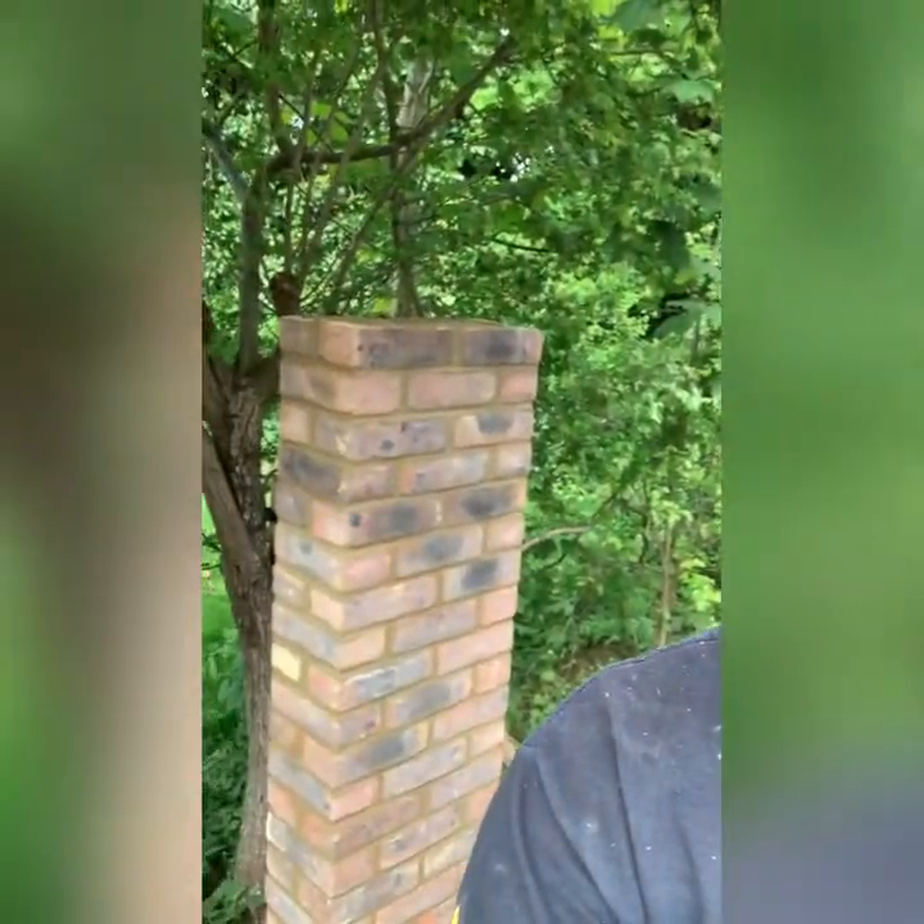Head over to bontool.uk and get yourself one. This is the 13-inch or 11-and-a-half-inch horse hair brush — best thing for brushing off brickwork. It leaves no brush marks. If you want to start making your jointing look a lot better — if you're already good at jointing but use a normal soft hand brush, you get the odd lines here and there — if you use the horse hair brush and brush off straight away, no lines in your mortar. It leaves your joints nice and tidy.